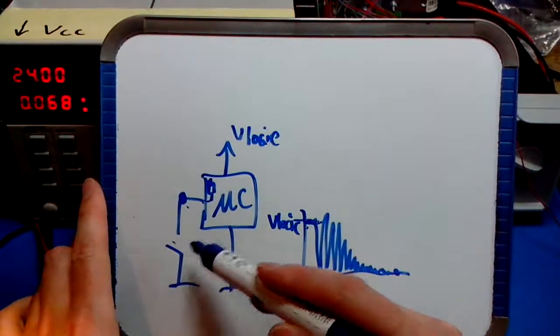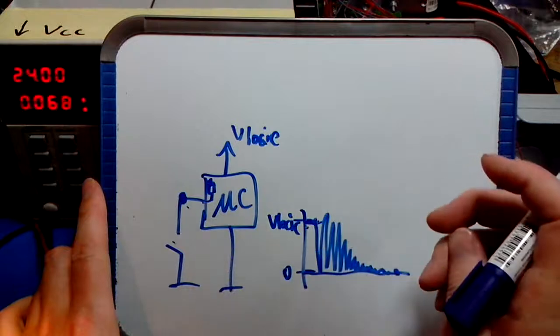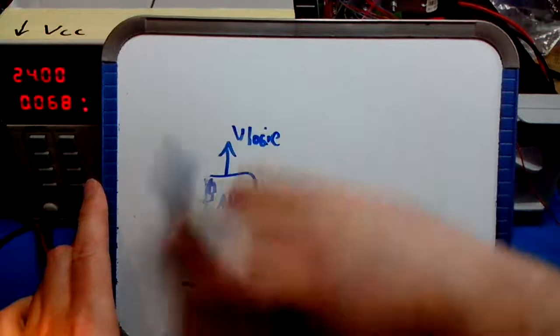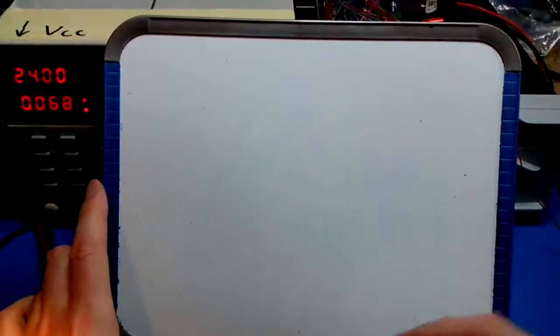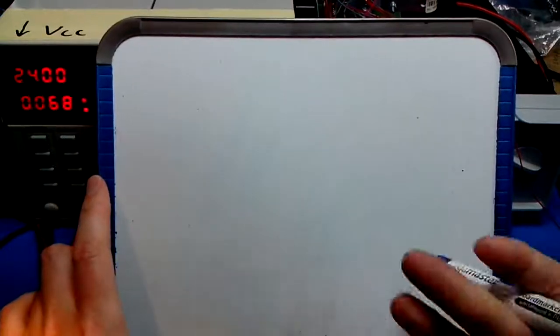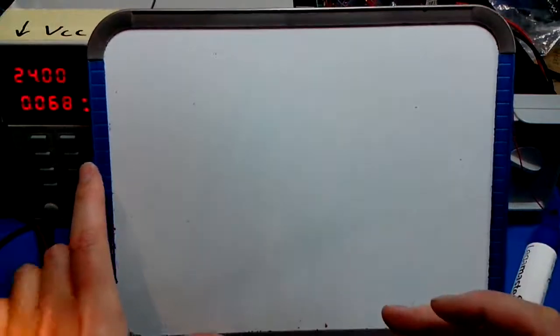One is with an RC, a low pass filter applied at the switch. Another one is with a flip-flop, I think. There's a lot of stuff. What I usually do, if I need a microcontroller anyway, is just do it in software, because I like it better. You have much more control over it. If you want, you can tune it per switch type.